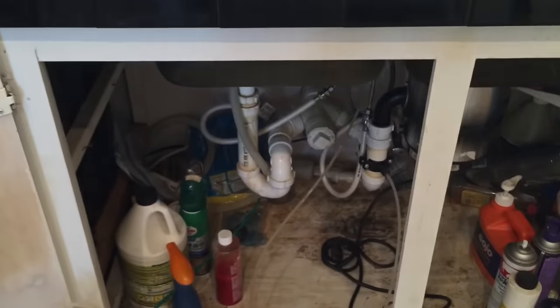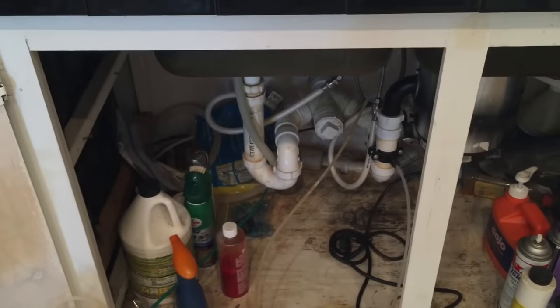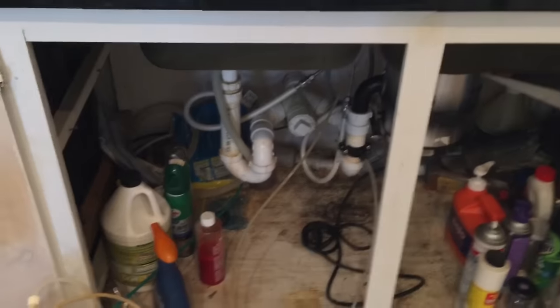What I'm going to do is tap a hole right in the center there. I don't need the big knockout hole — all I need is a small half-inch hole for my spigot for my distilled water. I'm going to have to rearrange the plumbing because my drains are here and here, and I'm going to block off this drain and rearrange the other drain. Hopefully I can line up without too much trouble, or I may end up coming off that center one and blocking the other two off.